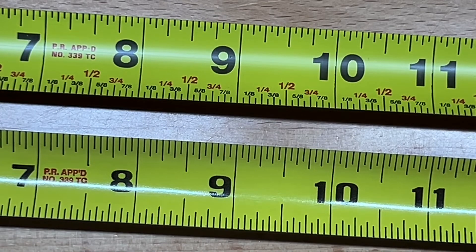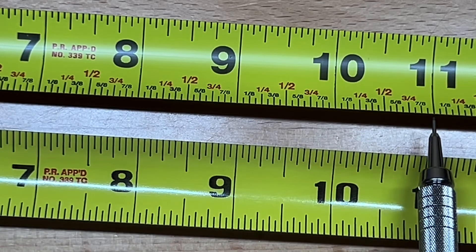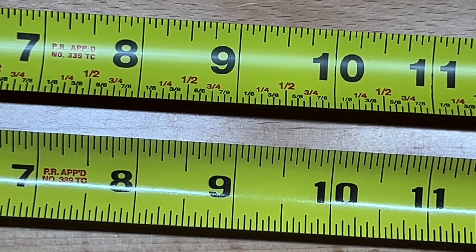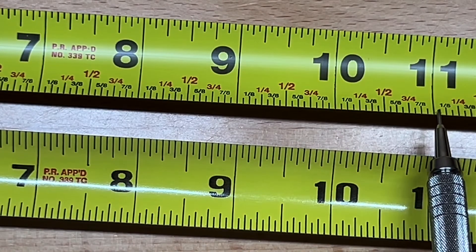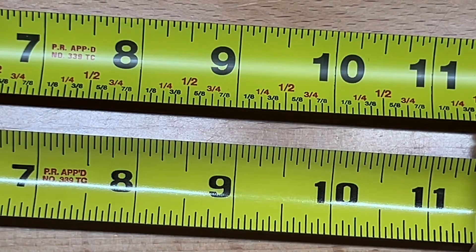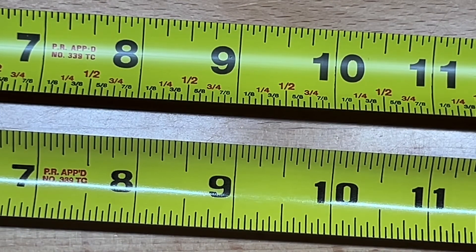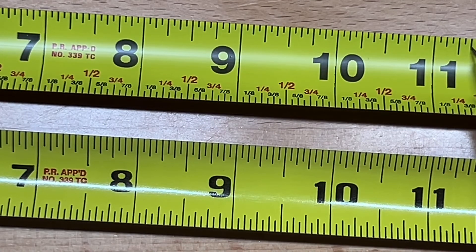If you're still having trouble reading the standardized tape measure, a good learning tool is these tape measures that have the fractions broken up into eighth inch increments. They don't break up the sixteenth, but that would be a lot of written information on the tape. I particularly like this style of tape with the fractions only on one side — the opposite side does not have them. If you're wanting to learn how to read the tape more effectively, these are great teaching aids. Through muscle memory, you'll start to learn that the longest tick mark is your half inch, the next longest is your quarter inch marks, then your eighth inch marks, and finally your sixteenth inch marks. Over time it will become easier and easier — the more you practice it, the easier it becomes.